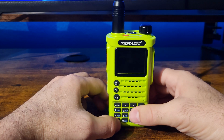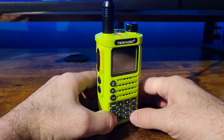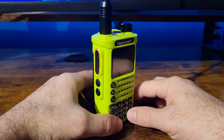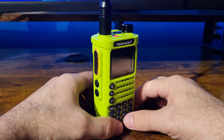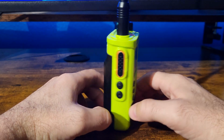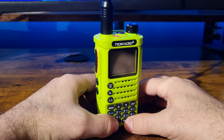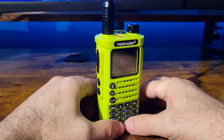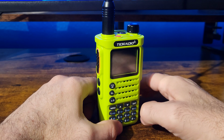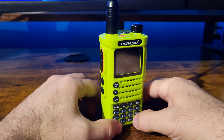This radio, I haven't tested it per watts, but I've seen other people test it and it gets up to 12 watts. Generally speaking, on high power, it's a 5-watt radio. It can go up to 10 or 12. So generally you'll want to choose not one of those channels that's 0.5 watts. You'll want to choose a channel that's, I think, 1 through 5 or 1 through 6 or 7, then skip over those middle ones and choose 15 through 22.